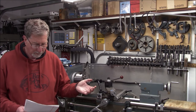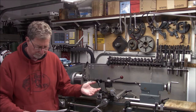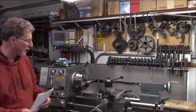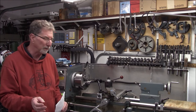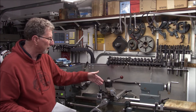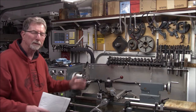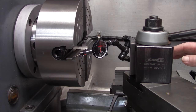There were quite a few comments on the cross slide. Comments noted: 'Cross slide should run slightly inwards giving you a concave effect when facing off,' 'I think your cross slide is giving you a concave reading,' and 'lathes are supposed to face slightly concave.' Someone also said it would be interesting to see where your indicator would end up if you kept moving across. I did do a test going all the way across. One of the challenges was that the cross slide only has about six and a half to seven inches of total travel, and our chuck face is eight inches across, so I split the difference.